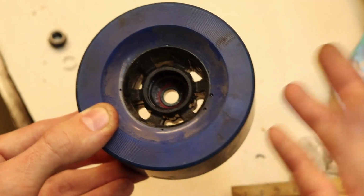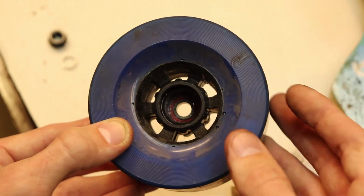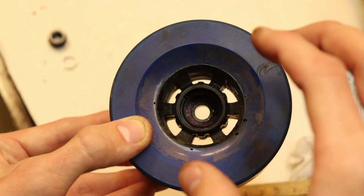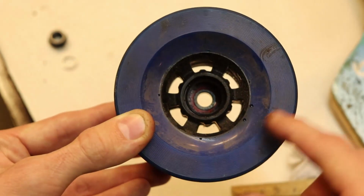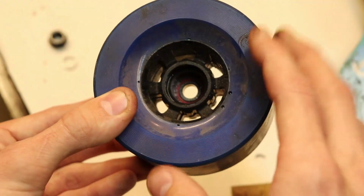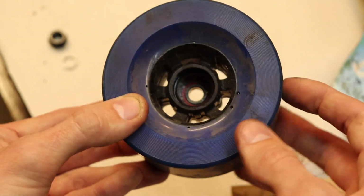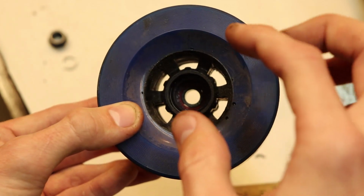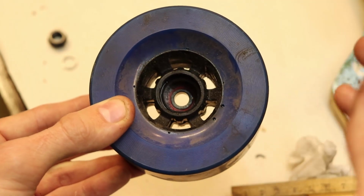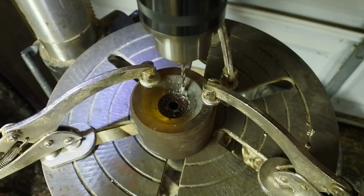Now, when you're connecting the motor to the wheel, you're going to need a bracket that goes on the wheel itself. You're going to need bolts that go through these holes and mount on the actual wheel, so the pulley can have something to attach to and drive the wheel, right? Now, with the 90mm wheels, I found that it's really easy to get those holes that you are looking for to mount that bracket in, and it's really simple. But I have also tried to make my own holes in smaller wheels, and let me tell you that it's not going to work out.